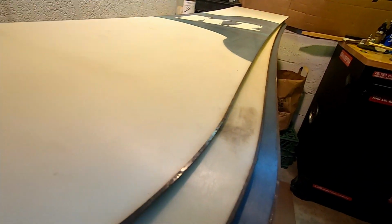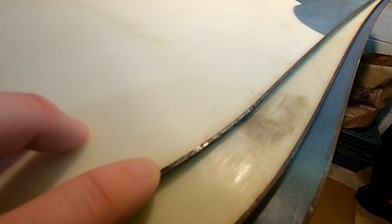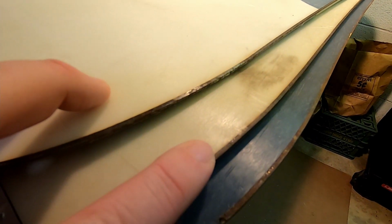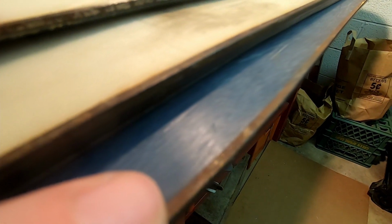Alright, let's start off by going over how bad the boards are. The large Fat Bob is actually not too bad, so my plan is to hit that with the Gummy Stones straight off. The Burton is pretty bad. I'm probably going to go straight to the file. And then same thing with the small Fat Bob. I know it's contradictory, but it is a small Fat Bob. And it is absolutely rusted to crap, so I'm definitely going to start with a file on these.